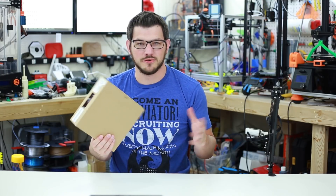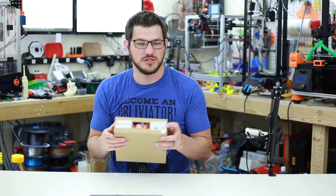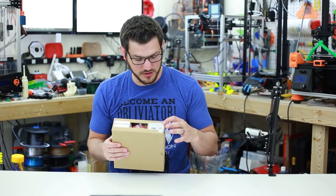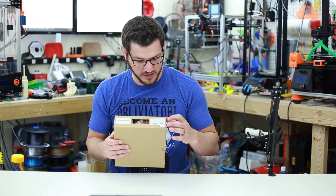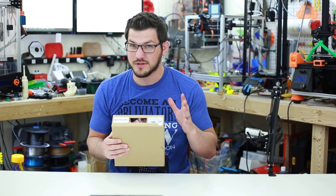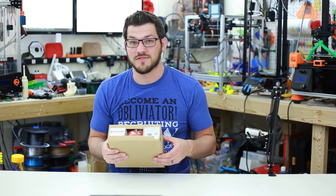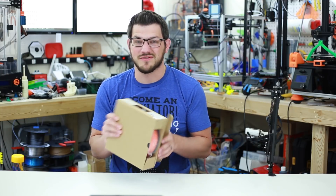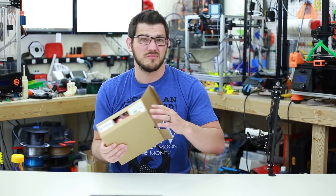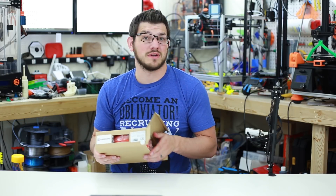So it's a plain simple brown box — no stickers on it except for the 3D Printing Canada sticker and the stats. It's PETG 1.75mm filament, dark orange. The recommended nozzle temp is 200 to 240°C — 200 is pretty low for PETG but we'll see. Bed temp is 75 to 85°C. I generally print at either 70 or 90°C on the print bed.